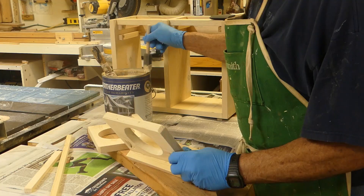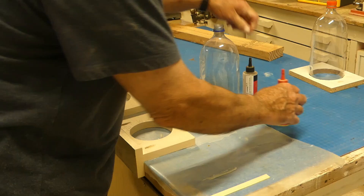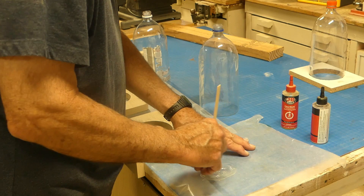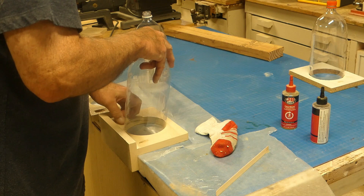Be sure to coat all four sides of the seed retainers with three coats of paint. Now it's time to permanently attach the bottles to the cartridge holders. I'm using a two-part clear epoxy compound, spreading it on the inside rim of the holder — try for a thin, even coat. Carefully insert the bottle on the bottom side and let it dry for a few hours. First, use a level before it sets up to make sure the bottle dries in the 90-degree vertical position.